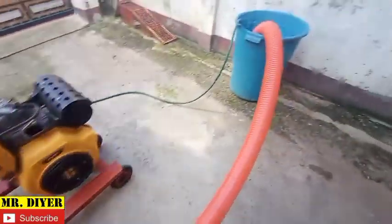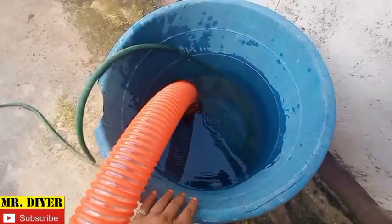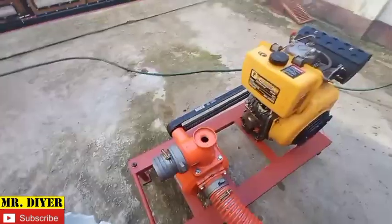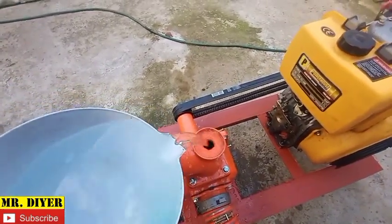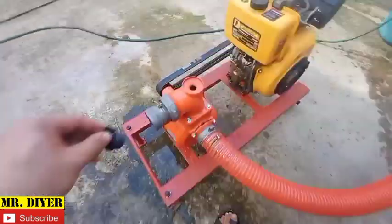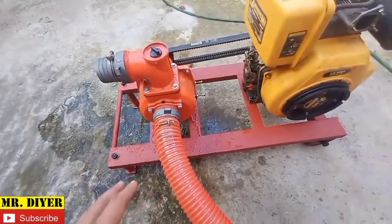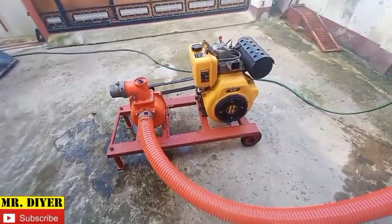I already installed the corrugated hose. This is our present setup. This is a 100 or 110 liter pail. I'm going to wait for this to fill up some more. We need to prime the pump — we need to fill it up with water. It started to come out, so let's put the cover back on. From what I know, once we start the engine it's going to take somewhere between 30 seconds and two minutes for the pump to start sucking water. Let's try — I'm going to start the engine.